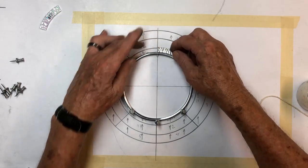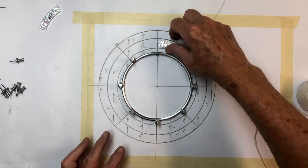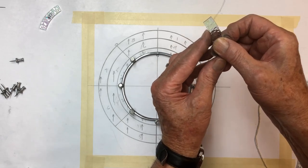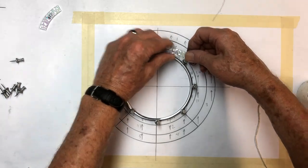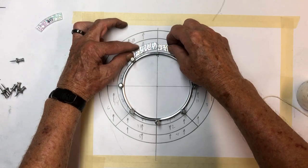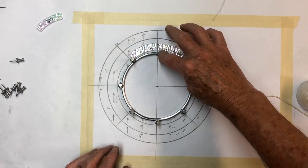And it's going to be lined up. But remember, we've got our little cotter pin right here. So this back side right here, we need to grind that back just a little bit, because here again, our cotter pin is going to push this out and it'll make it be too tall here. So I'll go offline. I'm going to grind this one and these two that go together here. We'll grind those back so that it doesn't interfere with our cotter pin,